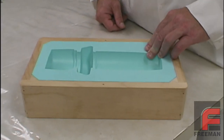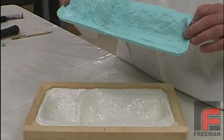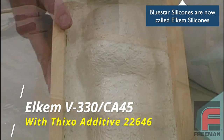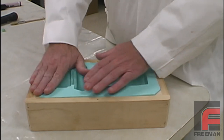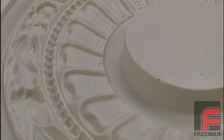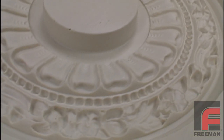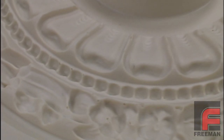Following the exact steps of the glove molding process will work for many medium-sized projects. Here is an example of a glove mold using Bluestar's VRM65, a brushable silicone rubber, and reprolaminating resin mixed with fiberglass strand as the backup material. Silicone, while being more expensive, is often preferred by those who require a very easy part release because silicone doesn't require any release agents. However, the typical glove molding process might not work as well for very intricately detailed models, since a thick material applied to such an irregular surface makes air entrapment almost unavoidable, resulting in minor defects.